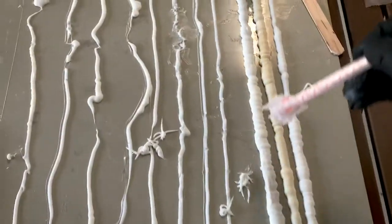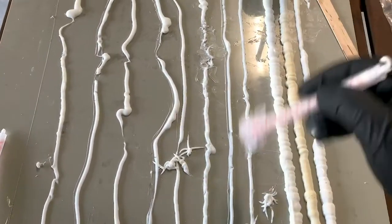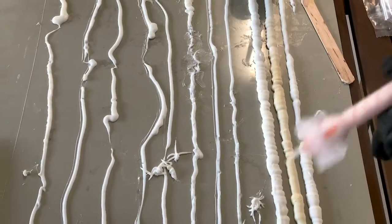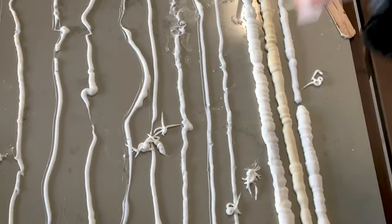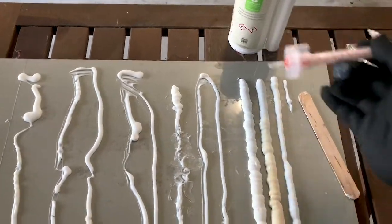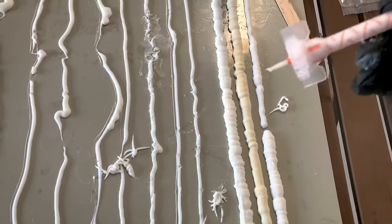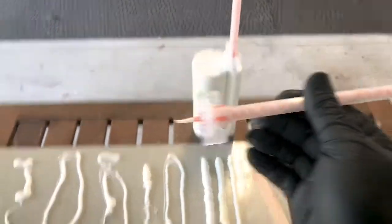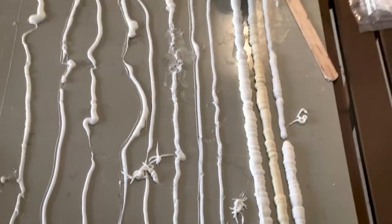And then the final, or the third dispense I did, after over pressuring the gun and the cartridge and causing uneven plunger heights and bad mix ratios, I then put on a clear mixing tip again, without purging. So what I didn't do was reset the height of the plungers and make them even. So even though I had free flowing adhesive, I still had an off mix ratio as the plungers came through. As the plunger moves through and resets and they become level again, you get a bad mix ratio, and we got the yellow adhesive that Steve Moltari's been complaining about.